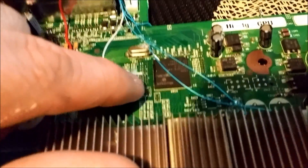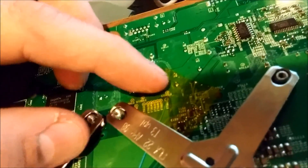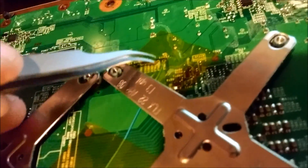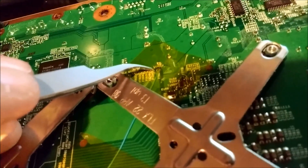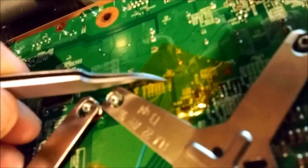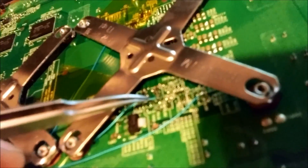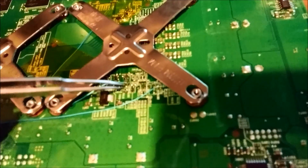It's really easy to knock that little tiny resistor off and end up bricking your console. Flipping this thing over — what you can see here is my post out. This is actually using post 0. Normally on a standard RGH2 install we use post 1, which is the other one. There's a space and then the connection is here to post 0. I believe this is the same post point that the CR4 uses sometimes.